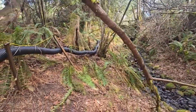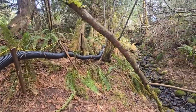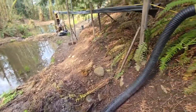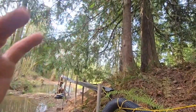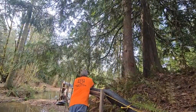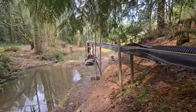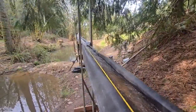The water comes down this pipe — the pipe does not have to be a gradual slope down to the wheel; it can go all over the place as long as this end is lower than that end, because the water is forced through. As you can see, that is a four-inch pipe. All we do is throw that pipe in that trough. We could have just used more pipe to reach that far, but it comes in hundred-foot rolls, so we built a trough and just used black plastic in it. It works pretty good, and the water runs down that trough and starts spinning the wheel.